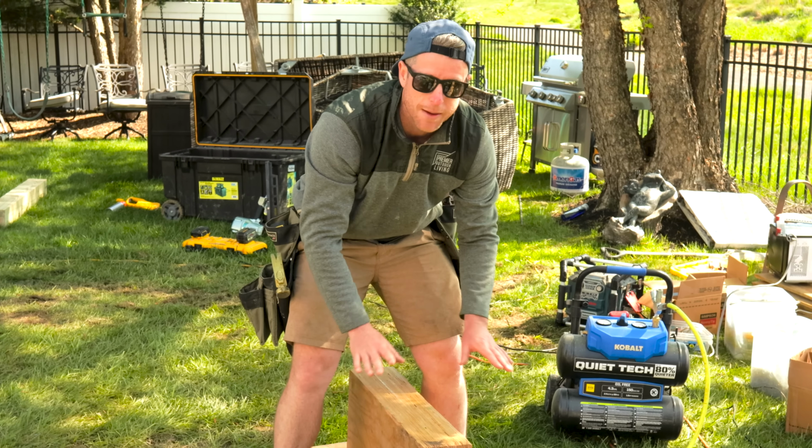The next step is where that planes into, which is going to be roughly here. You snap a line to this corner of the house. That's gonna create your valley, so when water comes down this roof, it hits that valley and shoots this way. And then all you have to do is put a few valley rafters in, put some plywood on it. You wanna cover it with ice and water shield. The roofers will take care of that. They'll take care of the flashing for us. Shingle it, it'll be dry in no time.